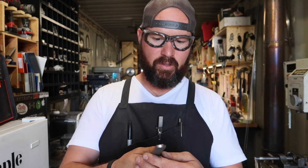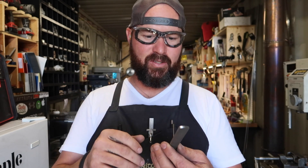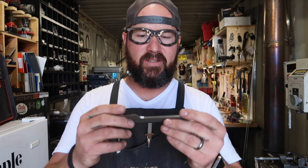Stainless steel is pretty brutal. You have to keep it super cool, super slow, because once it overheats and work hardens, it's too late. I've got a couple of reference lines marked out and I'm just going to eyeball this — I know that's going to drive a lot of machinists crazy, but that's kind of how I roll. See what happens.